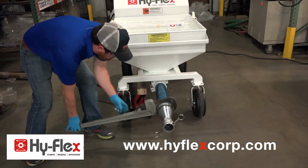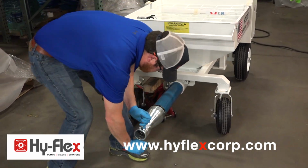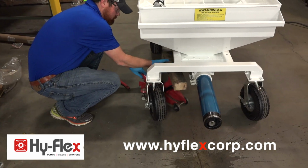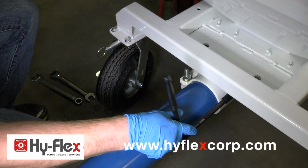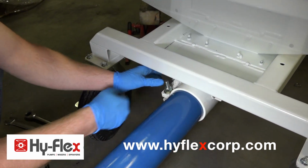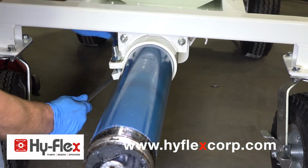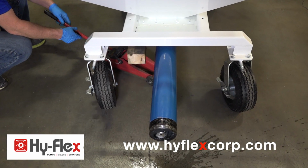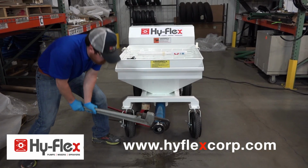Remove the stator tube reducer first. Remove the floor jack and block of wood. Loosen the adjustable clamp slide first. Loosen the bolts on the stator clamp and slide the clamp off. Support the frame with the floor jack and block of wood.